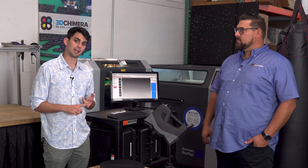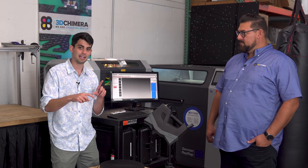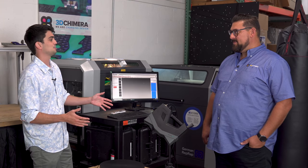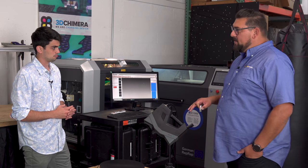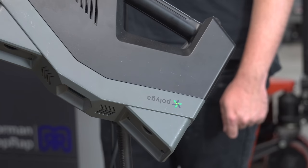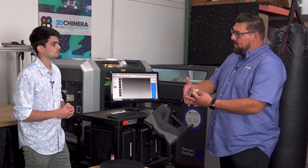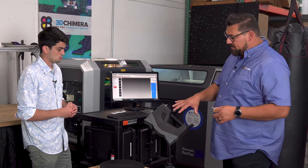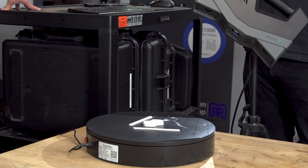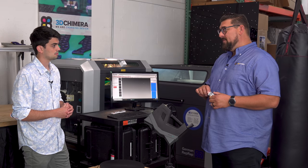I've done a lot of 3D printing and even more CAD design, but one hole in my knowledge is 3D scanning. I've had some experience with the iPhone and the rotating platter, but this system looks to be a little bit more complex. What differentiates the iPhone scanner from a professional system like this? This is a 3D scanner from Polyga — they're based out of Canada and make high-accuracy 3D scanners. We're going to be projecting a pattern on the object, then viewing and interpreting that pattern as 3-dimensional geometry. This uses a technology called Structured Light — a black-and-white pattern that looks like a QR code on the object, allowing you to get really fine details and super high-resolution data. We should be able to get within about 50 microns of this surface, which should be more than close enough for making our soft jaws.